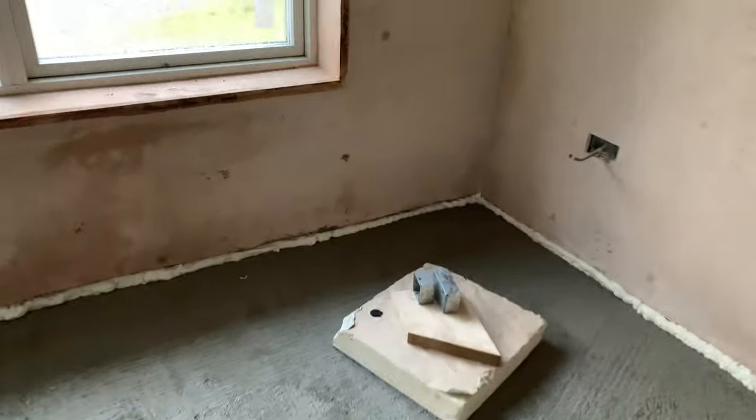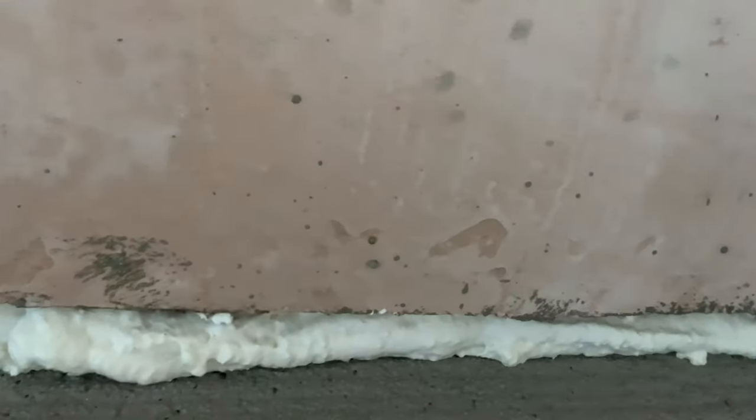That's the formal sitting room completely done. So just to give you an idea of depth wise, it's 100mm board, so we brought it out to approximately 70mm from the wall, leaving about 30mm of expansion. We will have a bit to cut off that, but what we didn't want to do was bring it right out flush to the board, because then you're going to have an awful lot of expansion and you'll be cutting off an awful lot of waste. So it's just a waste of money in that case. That's all filled in nice and neat and tidy all the way around.